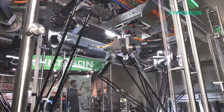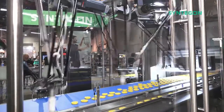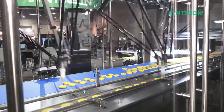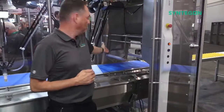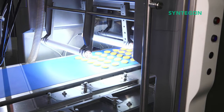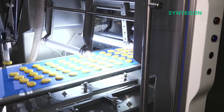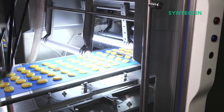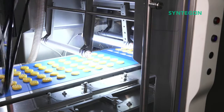We run cookies on this line and we can build stacks of two, or run single wrap cookies. We have a vision system integrated here — the vision camera is built in up top with top lighting. We can not only detect the products and transfer the position to the robots, but we can also do quality checks with this color camera system. This allows for detecting burnt cookies, for example, and of course we can also detect broken cookies.